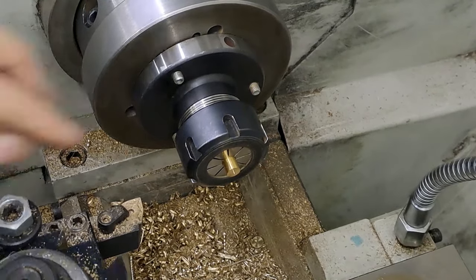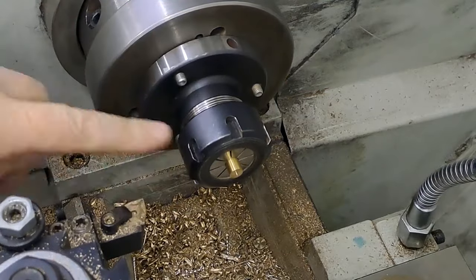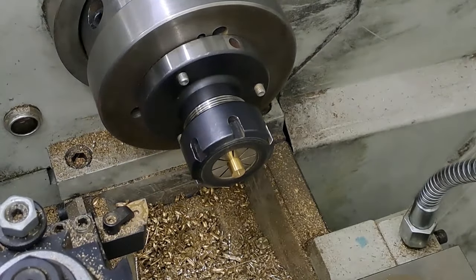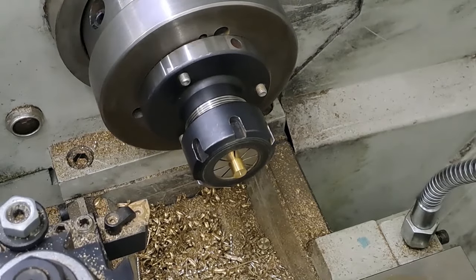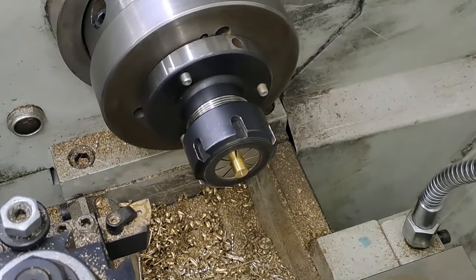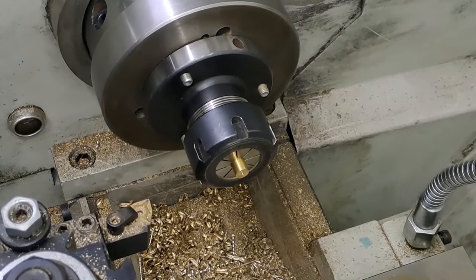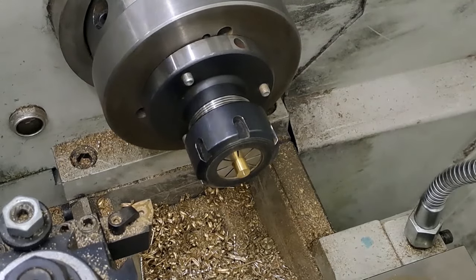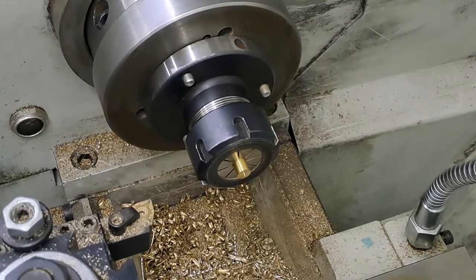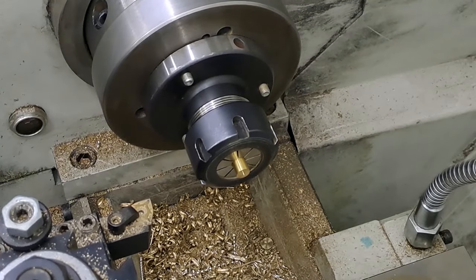Right, guys, so first embryo's in the collet chuck. Little tit to turn off first. Then it's the center drill, 5.2 mil, 3/32 all the way through. The 5.2 goes down to a little piece of tape that I've put on the drill itself, just to give me a marker. Once we've done the 3/32 all the way through, we'll change those out, put the M6 tap in, run the machine very slowly, and tap to the right depth, reverse that out, and this embryo is done.